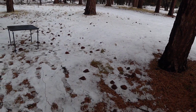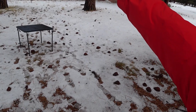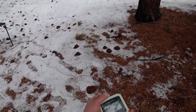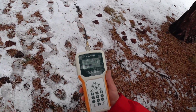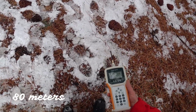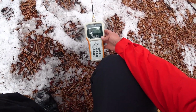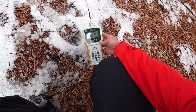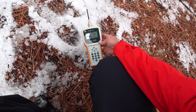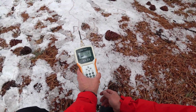Okay, so I have the wire strung up into the tree over there, sloping. I have my coax right here, and I am a lucky duck. Look at that, 2-to-1. If I lay the coax on the ground, like it will be with my KX2, 1.5-to-1 on 3.928. Oh my gosh, I just got lucky, I tell you.